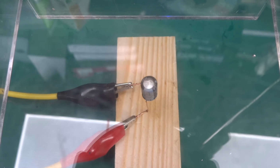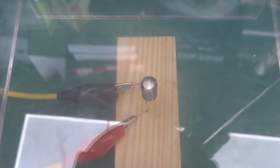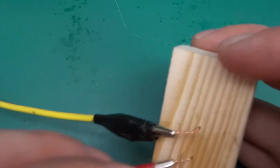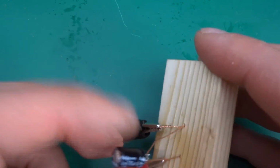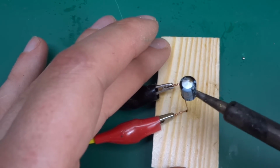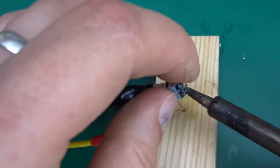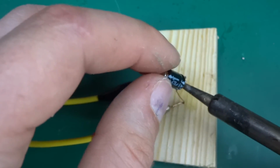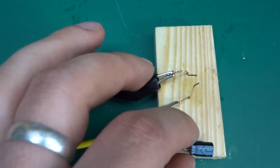11 volts, 1.2 amps. That's gonna go. And sorry, my camera stopped recording right in the middle. So yeah, this one failed really controllably. You could see just the beginning of it, and that's all that happened. There wasn't any bang on this occasion. It just simply vented really gently after drawing 1.2 amps from my power supply. The slot let go at the weakest point, and the whole thing just vented. Really controllable failure. And this is what you want, by the way.